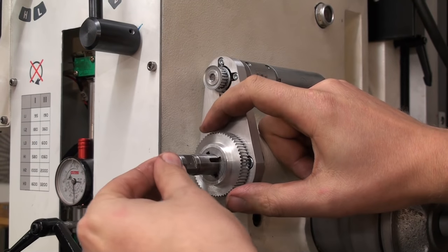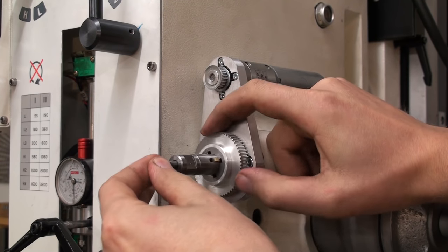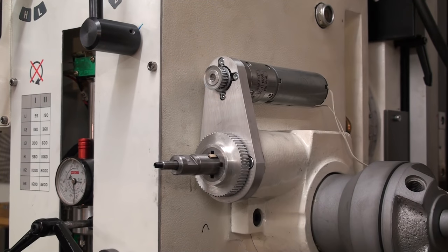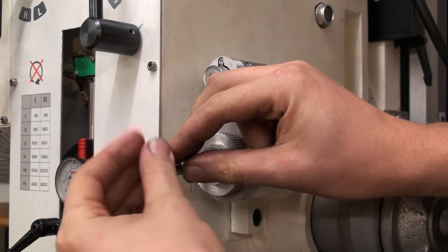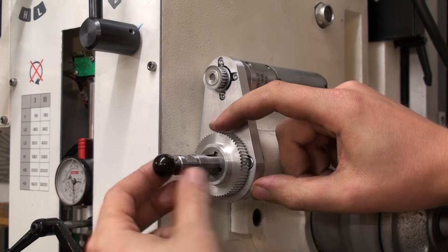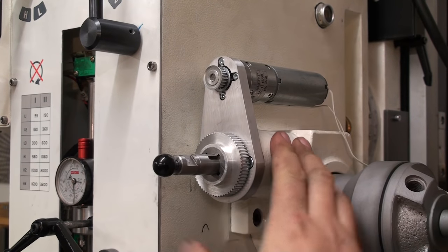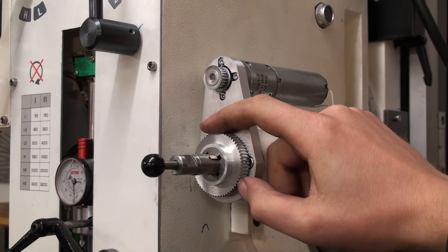So far everything works out perfectly fine. The key engages the timing belt gear nice and easy, and everything's hunky-dory. I also found a knob that I can screw on the end of the push rod. That's my clutch engagement and disengagement. I'll chamfer the edges of this key so the engagement goes even better when the key and the key slot don't line up perfectly.